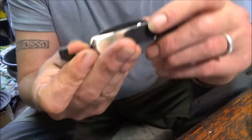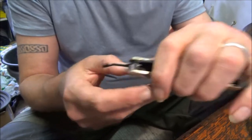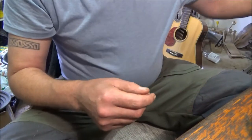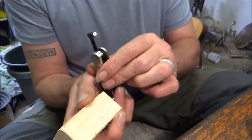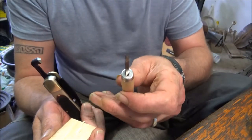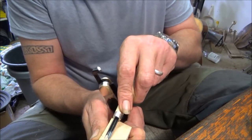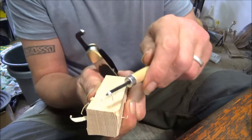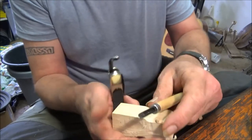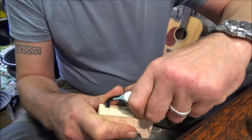These are sort of flat-bladed tools. There's a little V-tool here. What I do like about it is the orientation - as a V-tool, rather than pointing the other way, because when using a V-tool that way you're not using your thumb. When you're carving, I'll set this piece of wood here - if I'm using a V-tool pushing forward, this is sharp, this V-tool is very sharp actually, I sharpened it all up, so I don't need much pressure to take a V cut. Whereas doing cross grain, which is hard, you usually use your thumb as a lever. With this orientation I can put my thumb across it and use that.